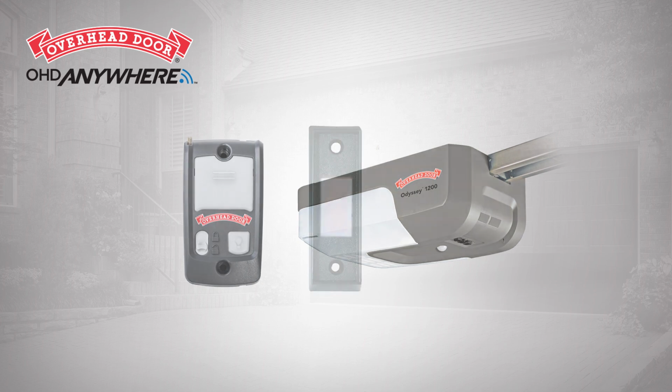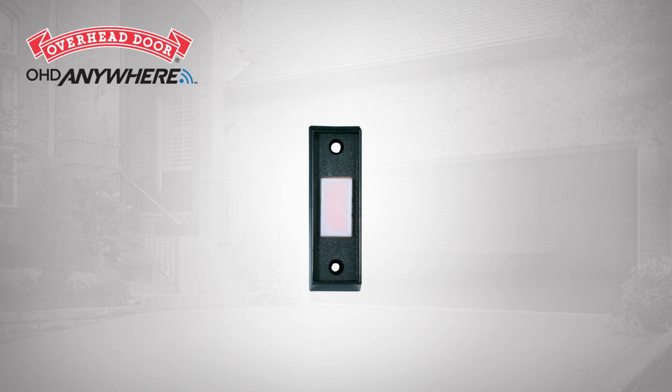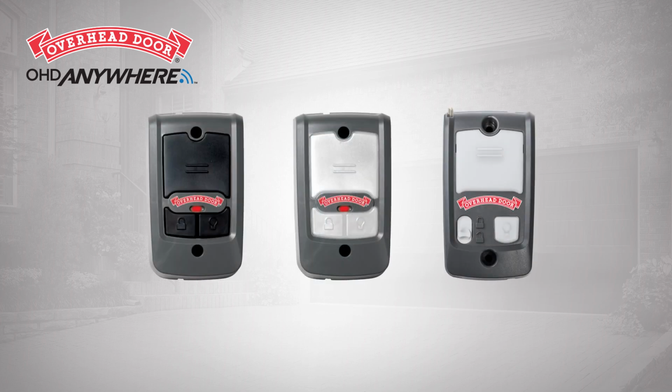The door control module can be wired directly to the wall control connections in the opener or directly to the wall console. If your garage door opener includes a basic doorbell-type wall button, it is recommended that you replace the wall button with the door control module, provided the Wi-Fi signal is optimal in that location. If your opener includes an advanced feature wall console, it is recommended that you wire the door control module directly to the wall button inputs on the opener so that you can retain the wall console's advanced features.